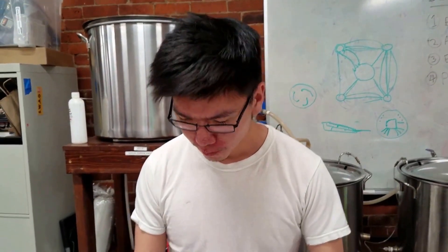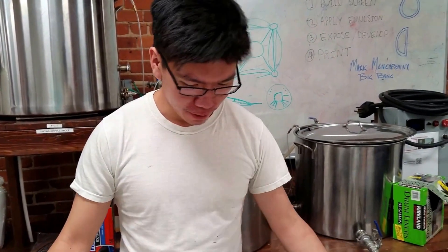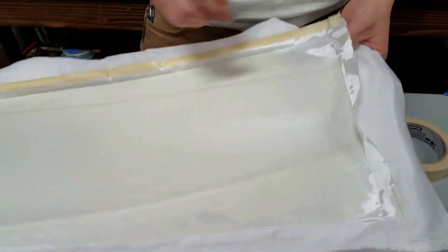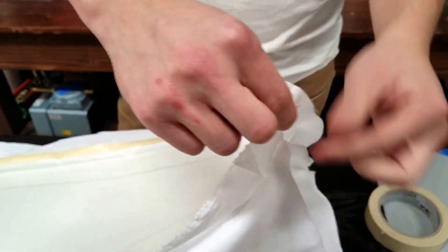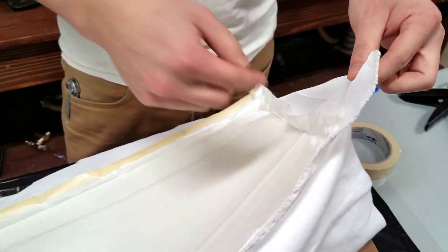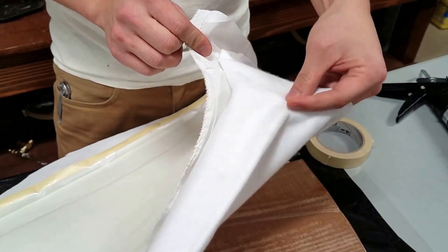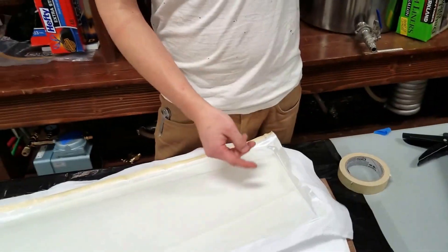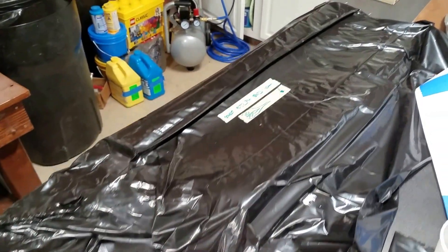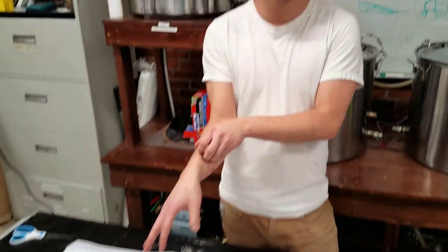So you took the fiberglass, put it underneath this cloth, and added a vacuum. Would you show me what the vacuum bag looks like? So this is the finished part which I haven't taken apart yet, but you can see there's the two layers of fiberglass. And then I put this layer here which is called peel ply — that's a breathable layer that lets epoxy soak through to pull as much epoxy out as possible, but it doesn't stick to your part. And then you have some sort of porous material like felt that just sucks up the epoxy. Then you have a bag and you pull vacuum and it's all sealed. You do that sandwich and then vacuum it in the bag.